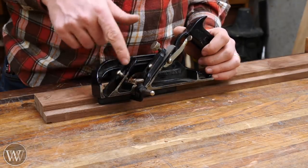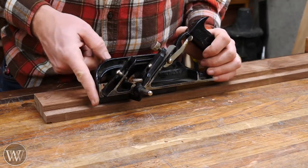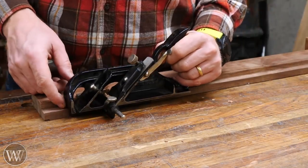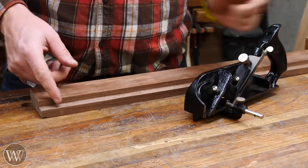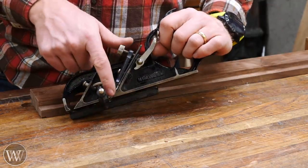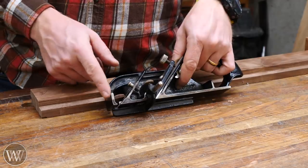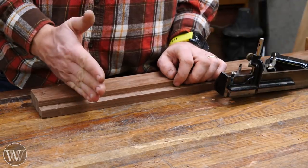The last question is why do we have this front bed — the second duplex? There's only about a quarter inch from the front of the bull nose to where the iron will be cutting, and that allows you to go up to a stop. If you don't want your rabbet to go all the way through the board, you can stop at one point, with each subsequent pass stopping a little farther back, until you only need to hand chisel out three or four inches near the end rather than almost a foot. Moving the iron all the way forward lets you get closer and closer to a corner. Some people even cut the bull nose off so the iron can go all the way up into a corner for a clean cut right up to a dead stop.